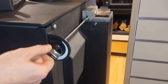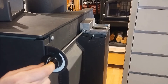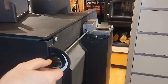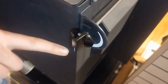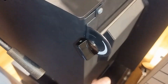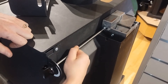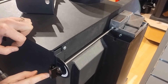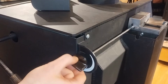As we close it all the way down, you can see the thermostat will have probably closed long before your dial stops moving — that is normal. If this dial is spinning freely apart from the knob and the thermostat, there is a set screw on the backside opposite the white line that you'll need an Allen key to access. Get the horizontal bar spun into a place where the set screw is stopped — it needs to line up with 6 o'clock — and then tighten the dial while it's pointing at 6 o'clock. That'll fix a lot of issues.